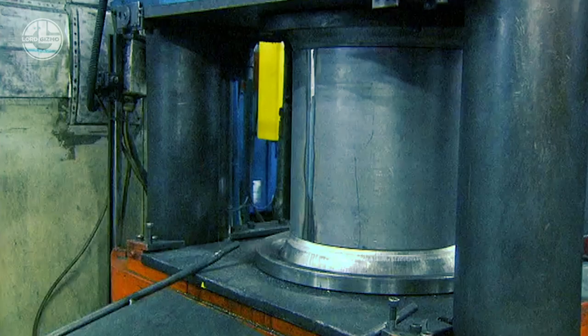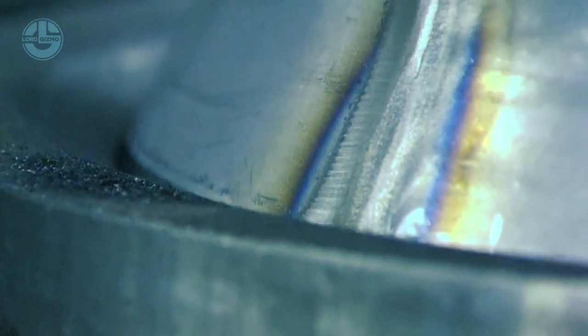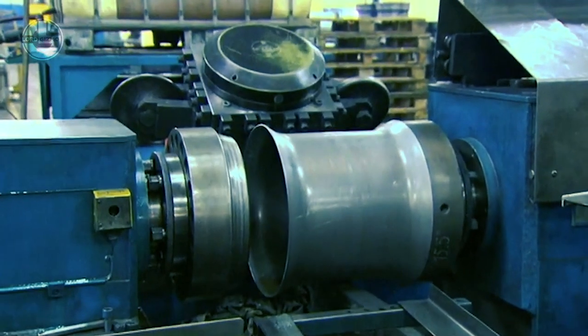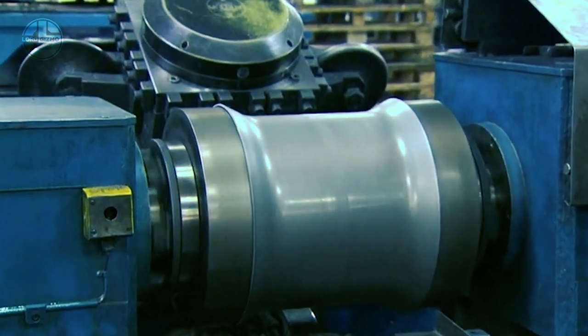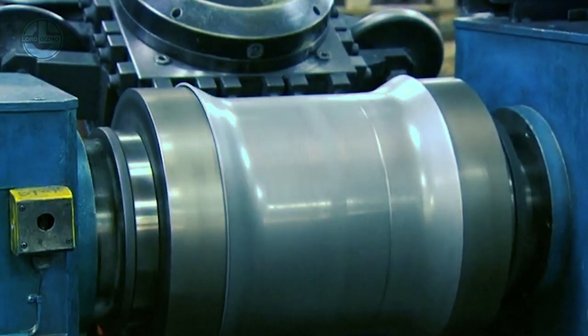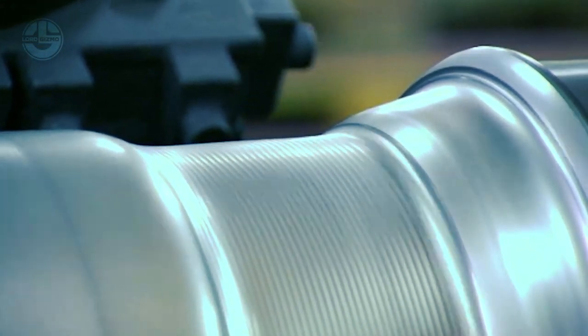After that, a roll forming machine is used for the symmetrical roll forming of wheel rims. Another component of the steel wheel is the steel disc. The disc is fitted inside the wheel rim so the whole frame can be connected to the vehicle hub. Once the frame cools, it is cleaned and immersed into a solution for the painting process. At last, the tire can be inserted.